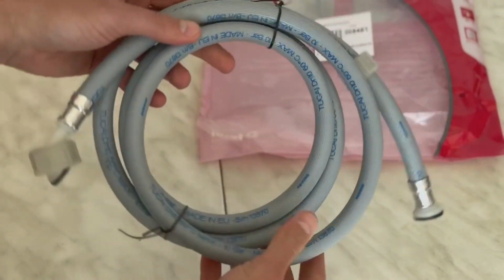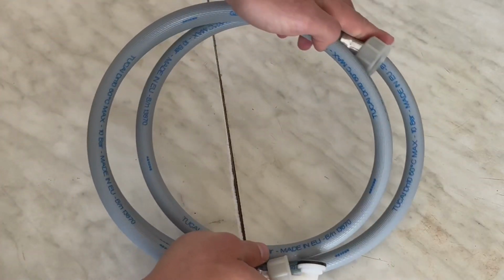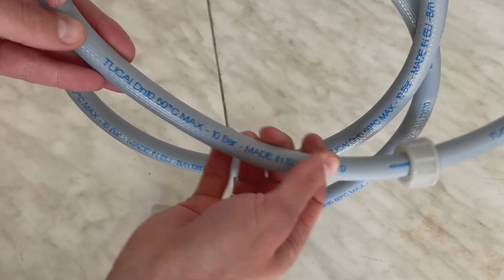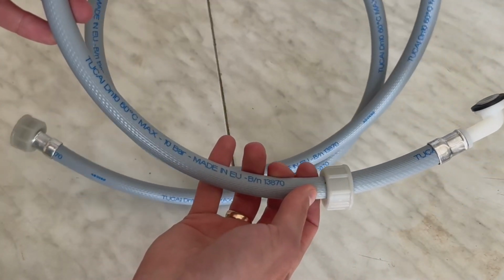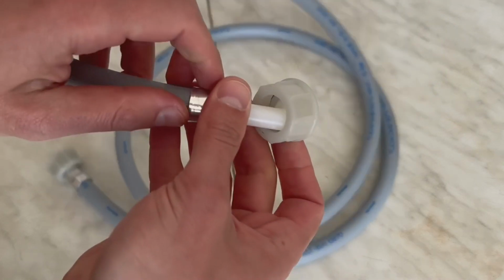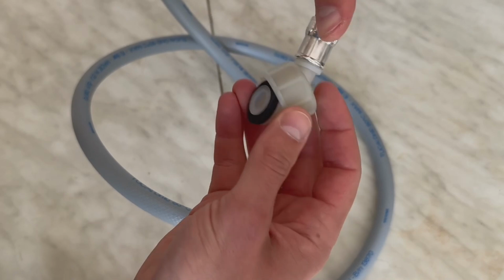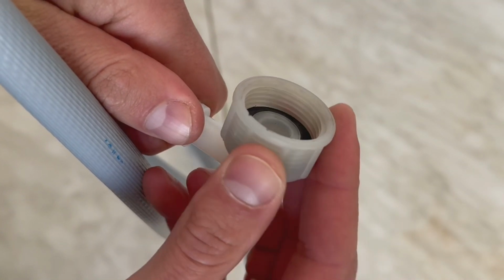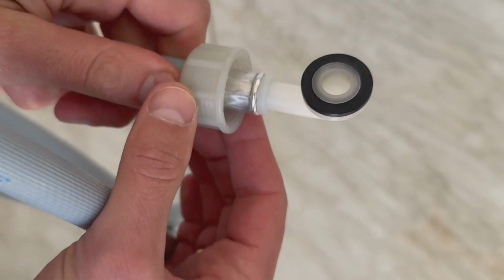In this case we have two options: either add another hose to the current hose, with the required additional length, or purchase a separate hose of the full required length. The second option is better in my opinion. After all, there will be no additional connections, which are always a risk of leakage. For example, inlet hoses have a length of 1, 2, 3, 4 or 5 meters.